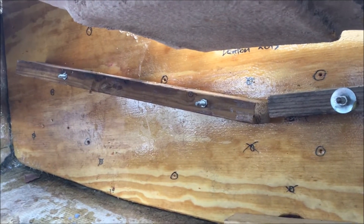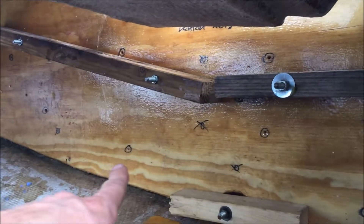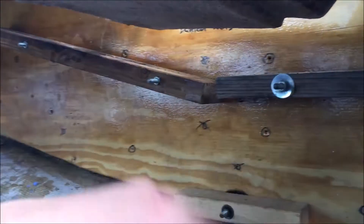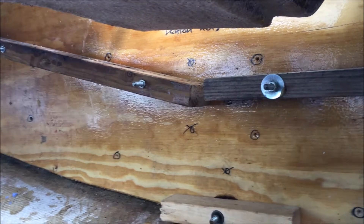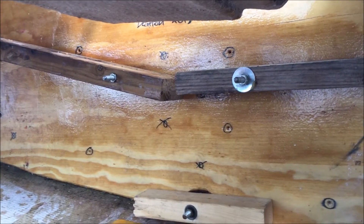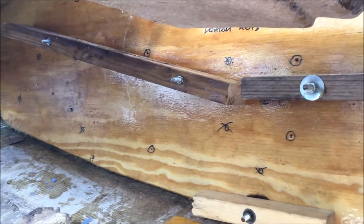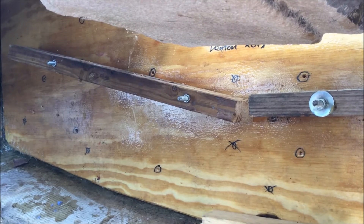While I have that thickened resin going, I'm going to squeeze it into all those screw holes I have here, and then run some screws into my transom, smear some more over top, and then glass over all of that. It'll make me feel better if I have some screws going into the two pieces of wood. I didn't really like how that liquid nails worked, but it'll be fine - I'll put those screws in there when I have the resin mixed up and seal it all up nice.